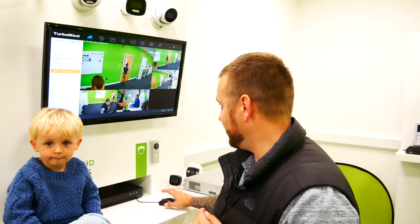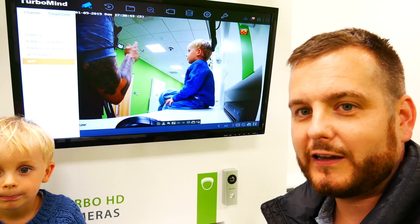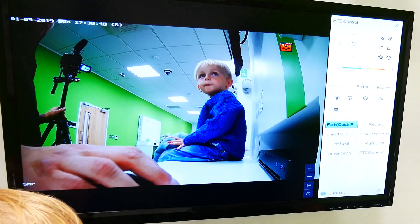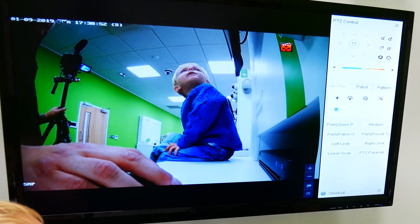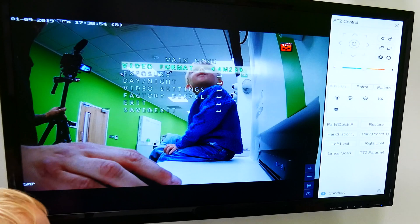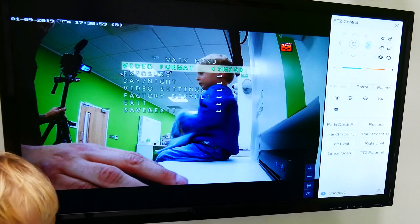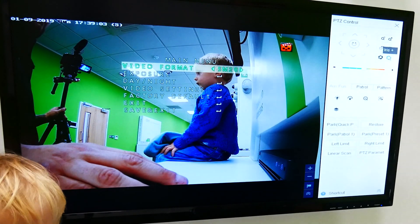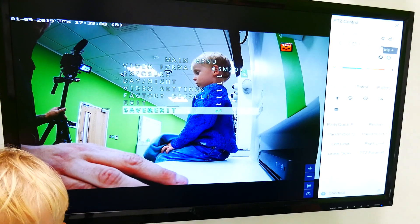So a really quick one — pull up the camera full screen. We're going to use the PTZ control icon, call it up using the menu function here, and you can see it says 4 megapixel 25 frames a second. We're going to change that to 5 megapixel, then press iris plus to save that. Go up to save and exit, iris plus again for enter.